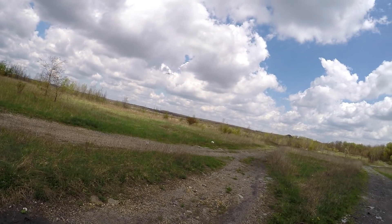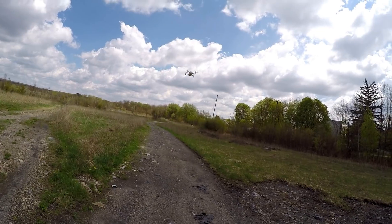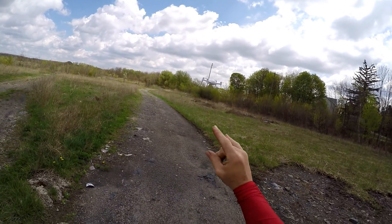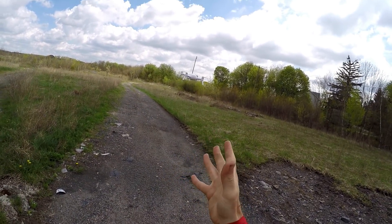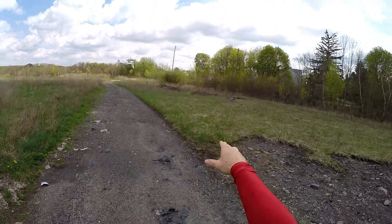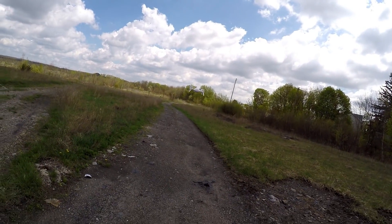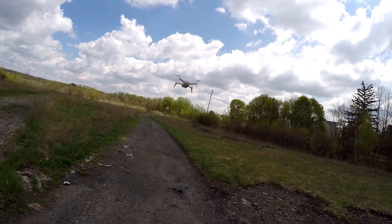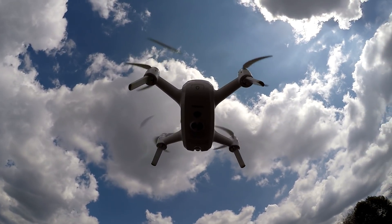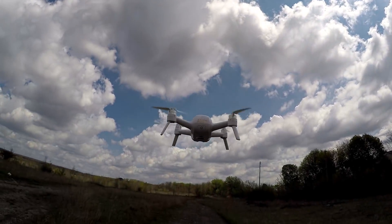Before, when I was sitting over top of this black surface — if you're new to my channel — this drone, prior to this, I flew it no problems. Then after a little while I guess the glass underneath got so smudged, over top of this dark surface it shoots straight up and then just free falls down. Over top of grass it would be good and you could fly it. But once you got over top of this dark surface, it would shoot up and then free fall down. I definitely think it has to do with that optical flow sensor glass. If you can see the spot underneath it there, it just moved up — it moved up with something underneath it.